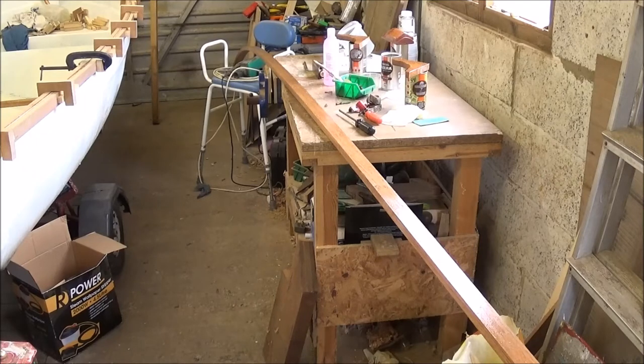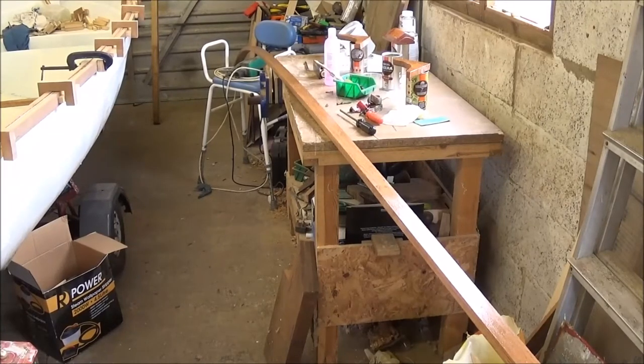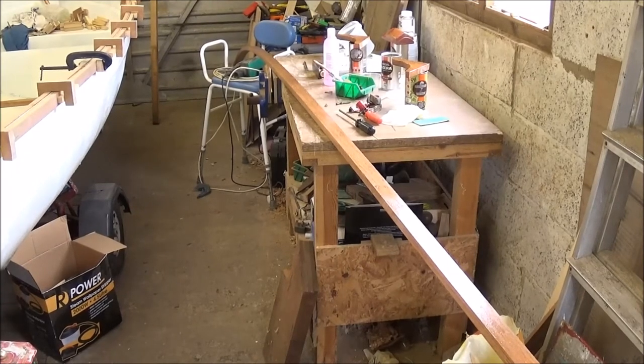The trouble is it's a bit hard to find anywhere to store them once they're drying. This has just had the first coat and I'm going to apply a second coat in a minute because it's dry now, and then find somewhere to put it and do the same with the other rail. The first coat seems to soak in quite a lot and the second coat sort of lays on the top, giving it a nice bit of protection from the damp, humidity, and water. Once they're fitted I shall varnish them as well.